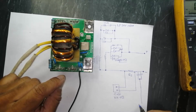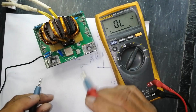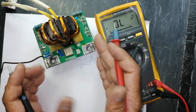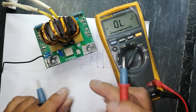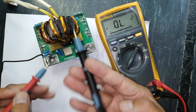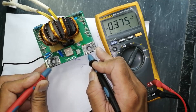The capacitors are connected to chassis ground. To test this output rectifier unit, set the multimeter to diode mode. When it is installed inside the welding machine, just connect one lead to the outside electrodes. In one direction it should show open; then reverse the leads and it should give a voltage drop of a diode.